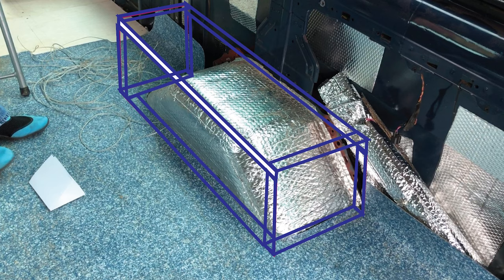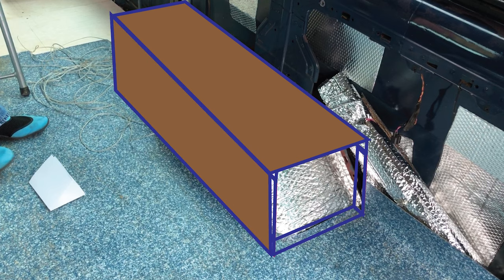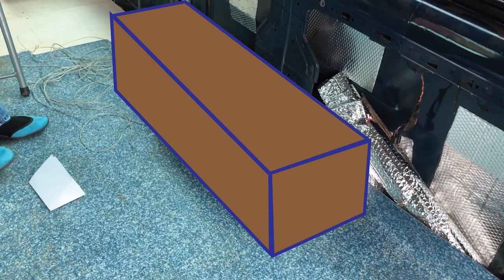Let's add the picture back in for a second. Once the frame's ready to go, we'll start with the top piece. This will have a slight overhang towards the inside of the van. The side piece will go on next and it will go underneath this overhang to give it a little bit of extra support. Then finally, the end pieces, which will box it off and just make a nice solid structure.